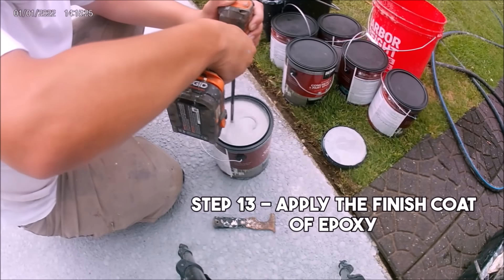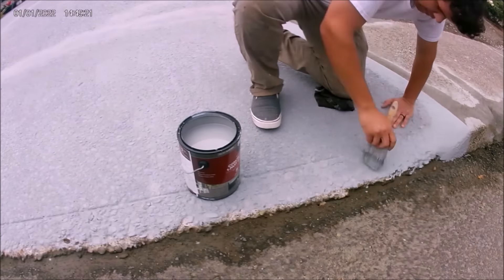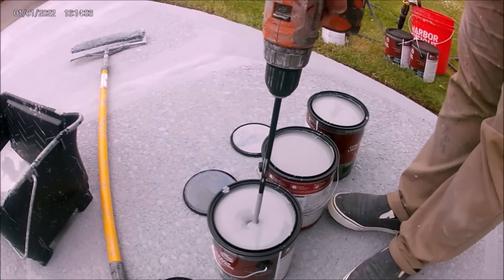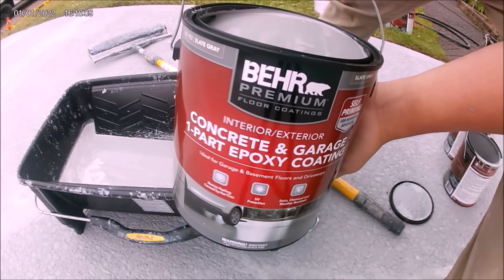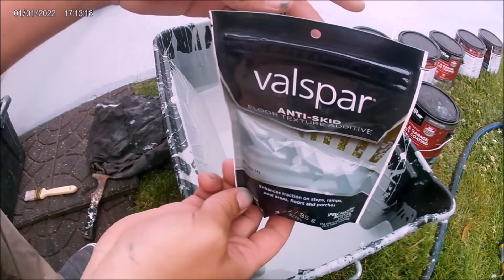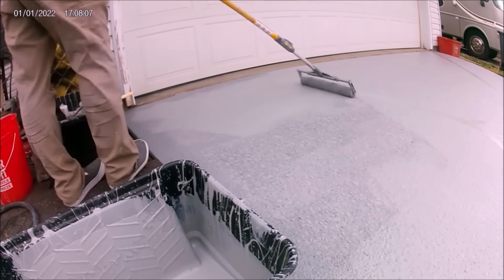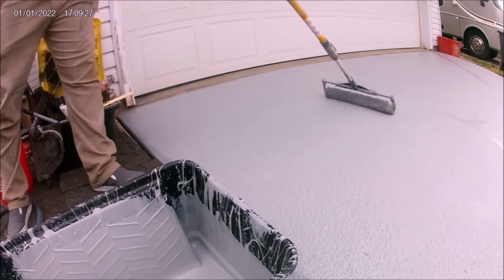Step 13 is to apply two layers of epoxy onto the whole primed surface. Be sure to mix in either anti-skid powder or at least a very fine sand. The two layers can be done one right after another, but keep in mind that adding more than two or three layers of epoxy within a 24-hour period can actually suffocate the first layer and cause poor curing. As a rule of thumb, if there's cloud cover, allow longer dry periods between layers. I personally only apply two layers of epoxy onto my initial thinned primer coat, and then I offer through my business one free recoat within the first year, which sometimes isn't even necessary for some clients.